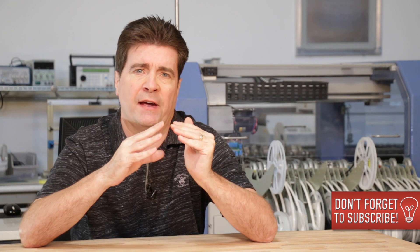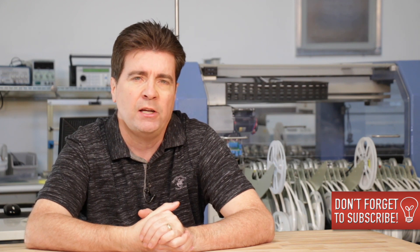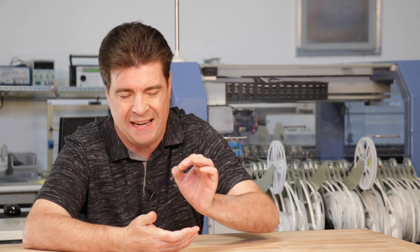We're really trying to get you to start thinking like an inventor. If I were you, I would really learn one of those CAD programs to use with your laser cutter. You export to what's called a DXF file, which is a flat drawing, and that's how you cut with the laser cutter. You can also engrave — you use bitmaps, and it scans over the part where you want to put a photo, text, or whatever image you're looking for.